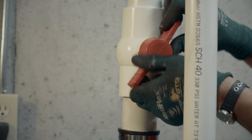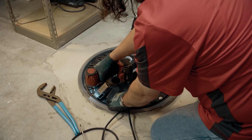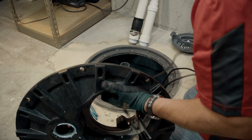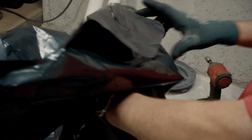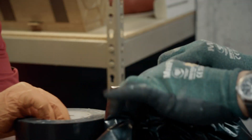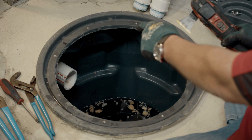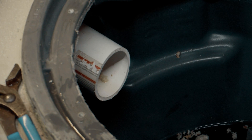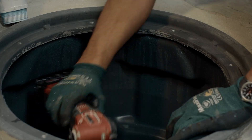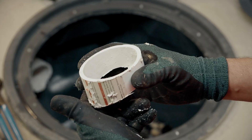Our next step is to turn this valve off and then start taking it apart. Caleb, get another bag ready for the pump and the duct tape. In a lot of installations we have the discharge pipe that sticks out quite far — we do have to trim this back some to make sure there is maximum gap for discharge. Here's how much I had to cut out.